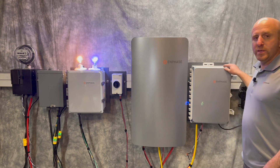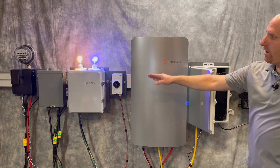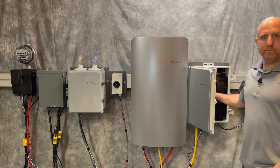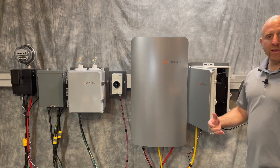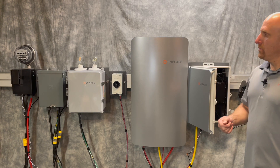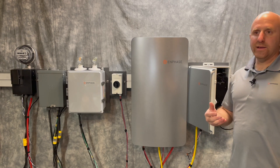I'm going to turn off the PV system to show you that there's no battery storage or other power source being used. The grid is still off as shown by the red lamp being off. Here I'm turning off the PV system, and our system has powered down. In the morning when there's enough sunlight, a manually configured or always-on load would come on as soon as possible.